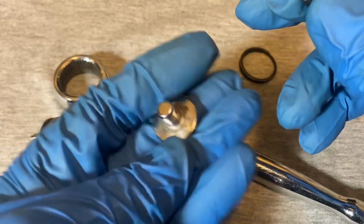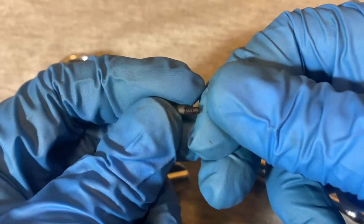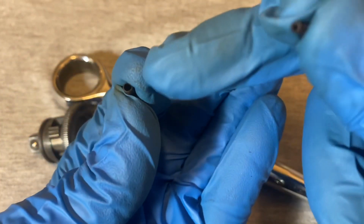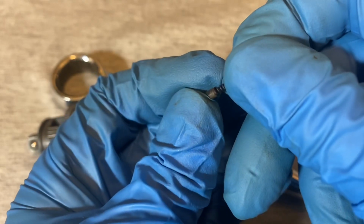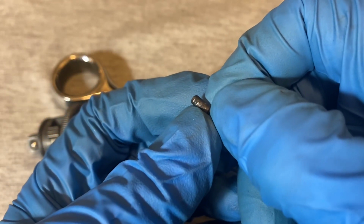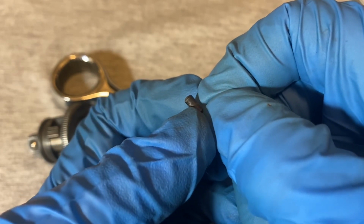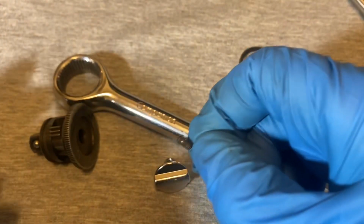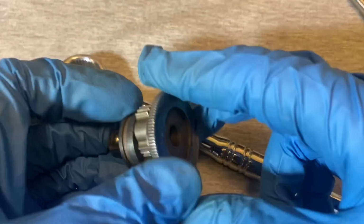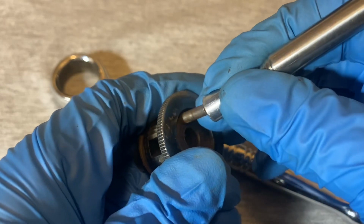It's made of metal. There's the hole where the spring and plunger sit in, and that's the spring. The spring looks a little bit long, and it's housed in this plunger, which is hollow. Another thing I don't like about this design is that these plungers usually get damaged, and you see those little indentations on the side, and they get stuck on the side of the walls there and interfere with the ratcheting, after a while, if they get pretty deep and really stuck on them.